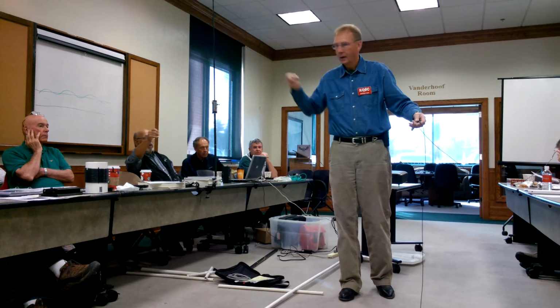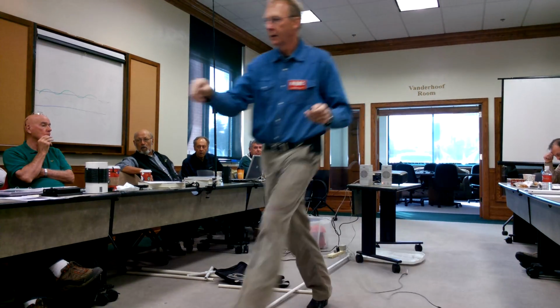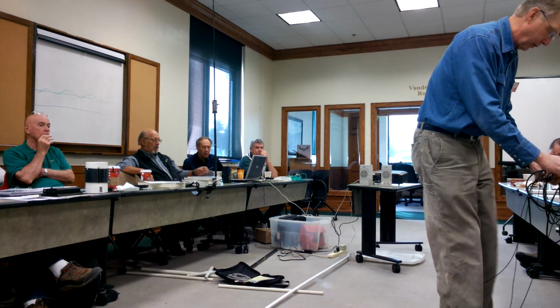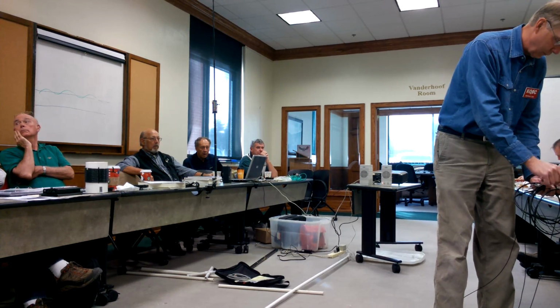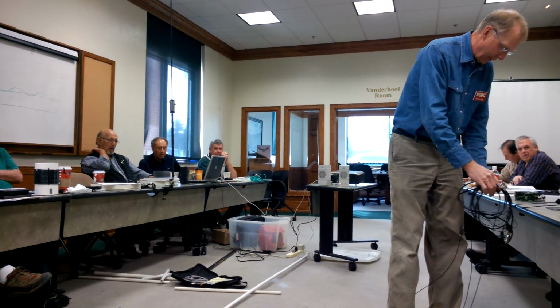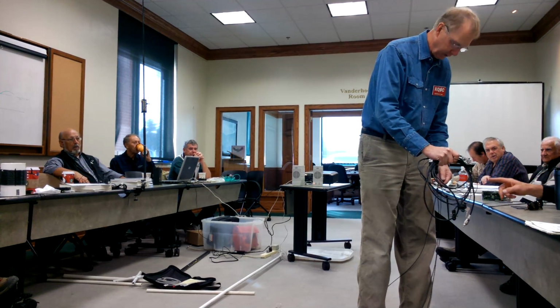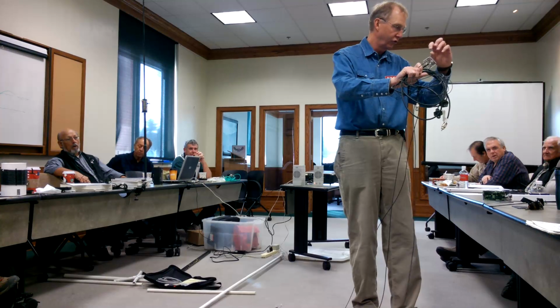How do those wires attach? I took a little jumper of coax and cut it in half, or you could take coax and solder a connection on it. And I took the inside coated bit and brought it back out of the insulation a couple inches back from where I cut it off, pulled it out, and then just soldered those. There's 3 wires and 2 on the coax. No, there's 2 wires in the coax. Oh yeah. The 2 radials are both attached to the outer shield of the coax.